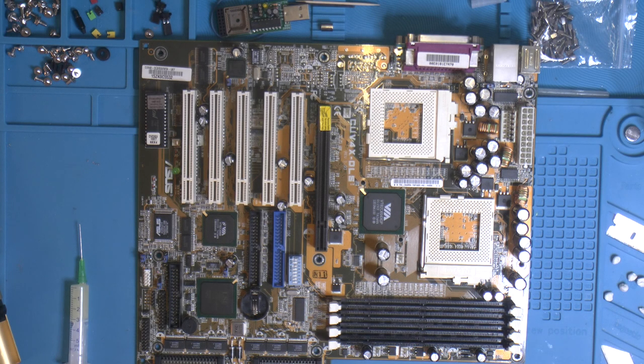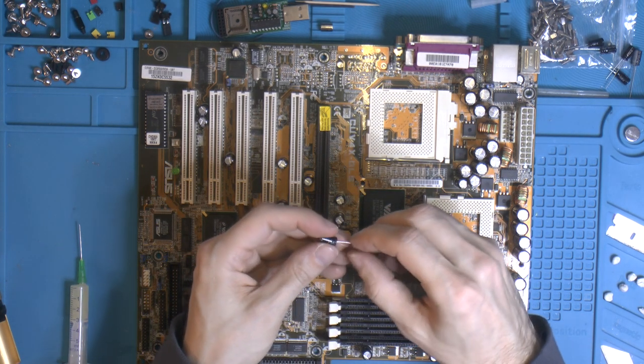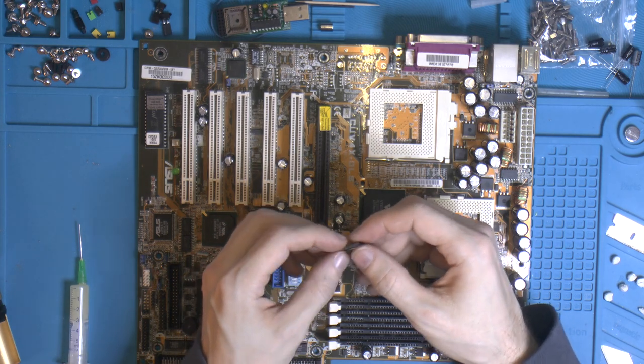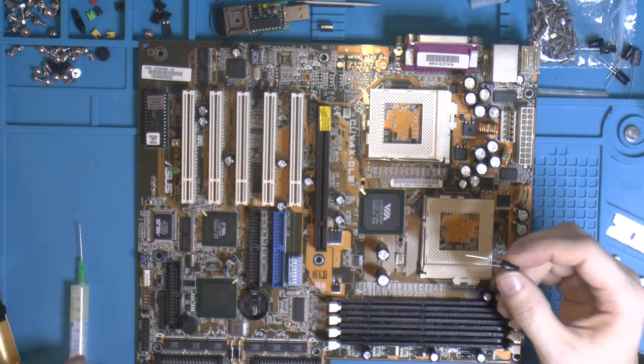I think that's all the green and under the 1000 microfarad. I marked those as green caps on my cap list. We need 6 100 microfarads now. So as before, these are low ESR Panasonic FR caps. So 6 of them we need. Just around the memory slots, it seems.